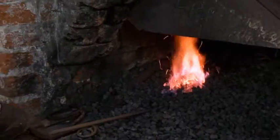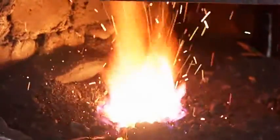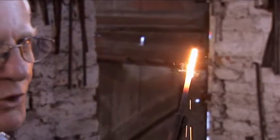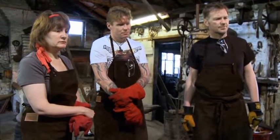Small area. The temperature you need to work out for this is between yellow and down to dark red. So if you see white sparks in the fire, it's because your metal is burning away inside. That's too hot for what we're doing — a fire cracker. So don't get it as hot as that and you'll be fine.